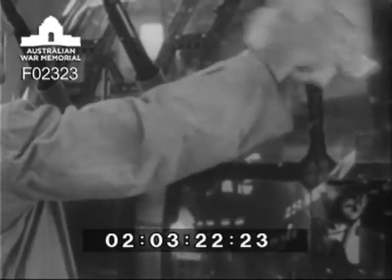Begin the daily inspection with a general inspection of the turret for damage and security. Examine the transparent panels of the cupola for cracks and other damage, and clean as necessary. Ensure that the panel in front of the sight is not scratched. When inspecting a turret installed in an aeroplane, pay particular attention to the 12 mounting bolts.